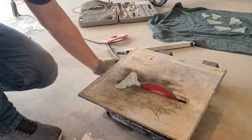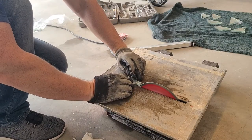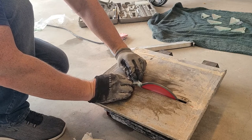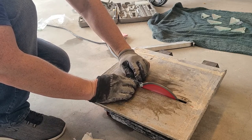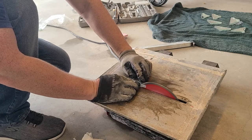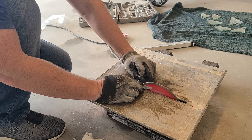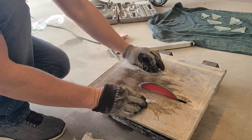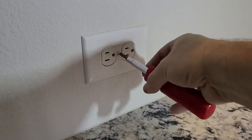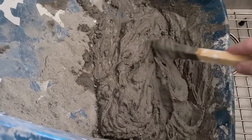For later cuts I started pushing the glass through halfway, turning the tile saw off, turning the piece around, and then pushing it through the other way. That way the cuts would meet in the middle and hopefully not snap off the end, but even that wasn't perfect. If somebody has a great way to cut glass tile I'd love to hear it in the comments. I do have a glass cutter which I've used on other projects, but I just can't get that thing to reliably snap along the score line.